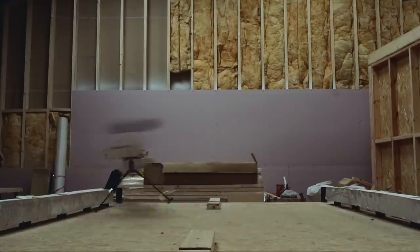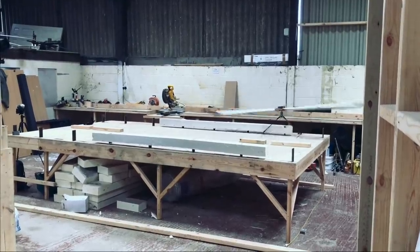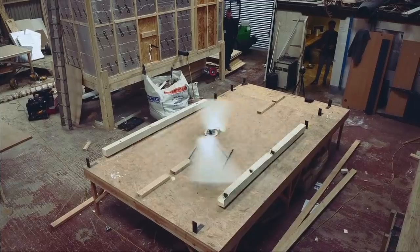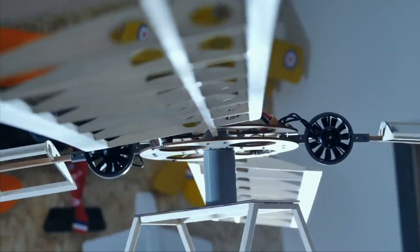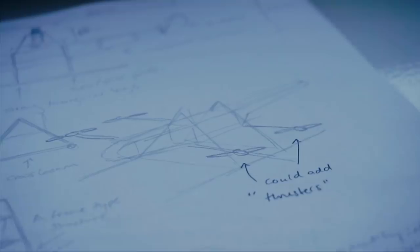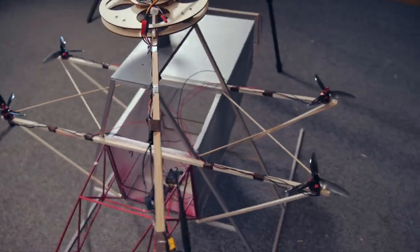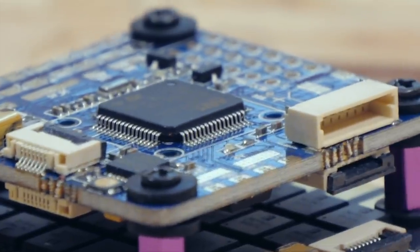So far I've learned that you definitely need to make your helicopter as light as possible so that the rotors don't have to spin up that fast, which was discovered when I tested my Mark 1 machine, which was quite heavy. Moving on to a lighter wooden design with a fuselage and four blades, I progressed from a machine with no control whatsoever to one that could have a system of thrusters — four small drone motors and a flight controller that would try to self-level the helicopter.